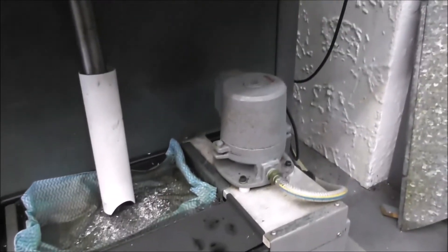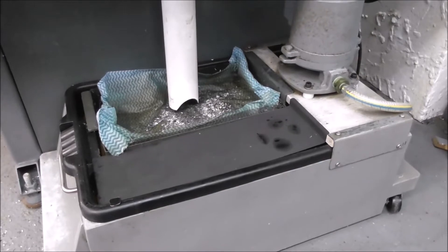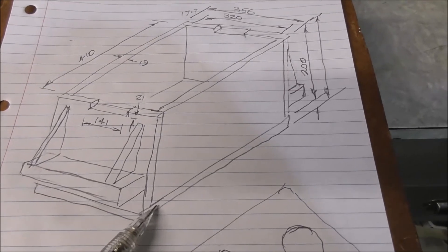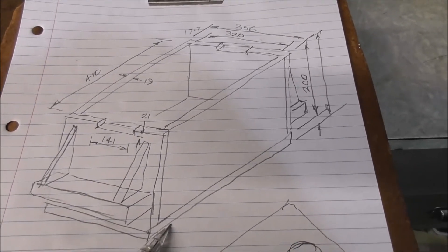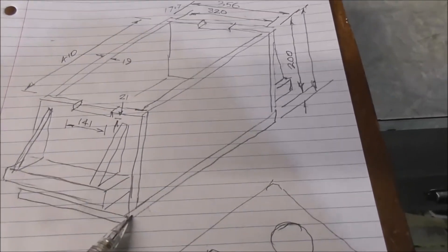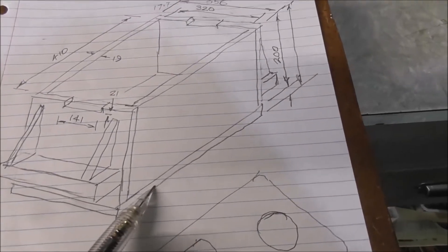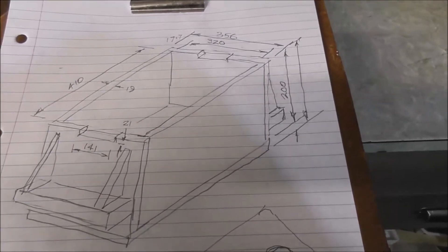This is a bigger tank with a bigger motor so I can have high-pressure flood cooling for more swarf-control intensive machining operations. Here's a sketch showing the construction: the base comes right to the outside so the box container sits on top of it. It's quite heavy with coolant inside, so it's a good idea to have the base fully on the bottom rather than the sides on the base — though with woodworking PVA glue and a few screws it'll be massively strong.